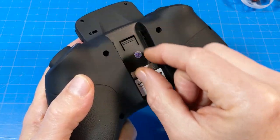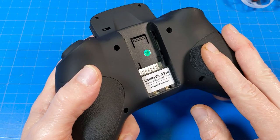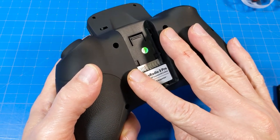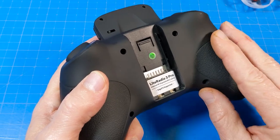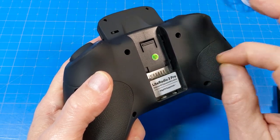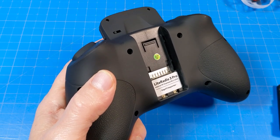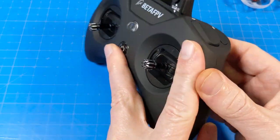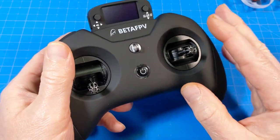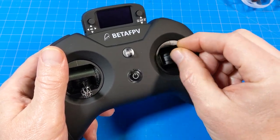The nano bay it supports — they list a whole bunch of different ones on their website. If you're getting the ExpressLRS version and also want to transition other quads that aren't on ExpressLRS to this radio, getting one of those XJT or iRange nano modules should slide right in there. This does have a 1S 2000mAh battery in it. Maximum power on this unit is 250 milliwatts — if you're looking for one watt, that seems excessive to me. I fly at 250 for the most part. The gimbals are hall sensor gimbals.